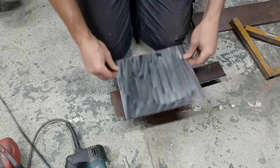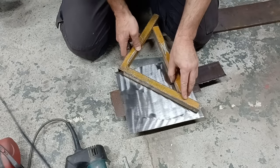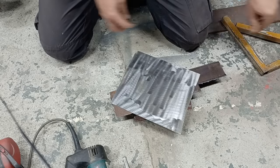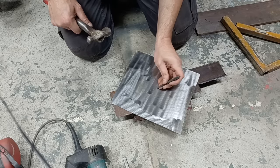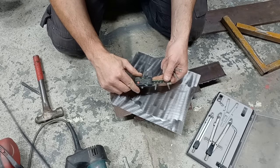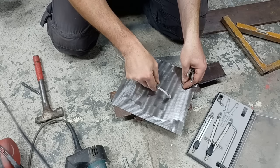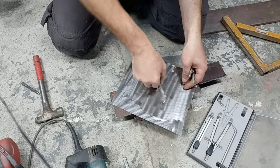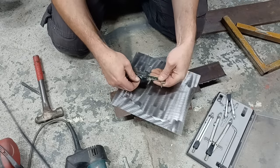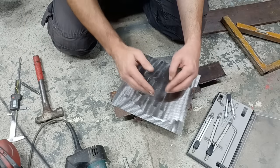Grabbed a bit of steel and just given it a basic cleanup, get the worst of the rot off — there's only a bit of surface rust. If we find the centre of that, this is probably just going to be a practice run to begin with. We set the compass to 46.5 — that should give us 93mm. It's no good to me just cutting that out because we want this to be turned up and out to grab hold of.